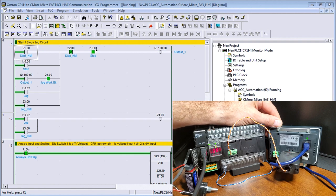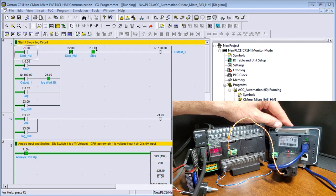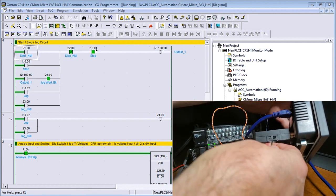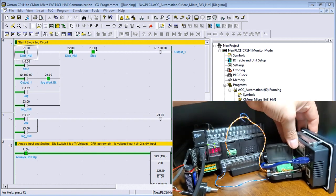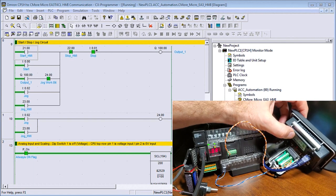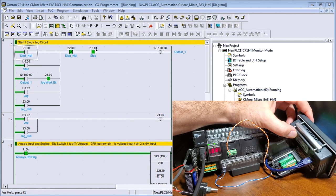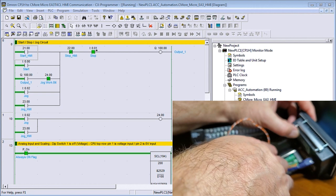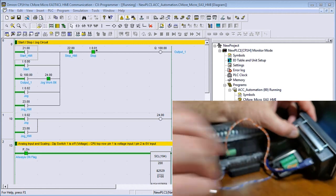You can also see that we have this connector, and this connector goes to a DB15 on the unit. And these are great little gadgets. If I just pop that open, you will actually see the wiring diagram. Everything goes to terminals, and everything's labeled on here. And so we see 9 and 10 are my send receive, and 11 and 12 are my other jumper cables.